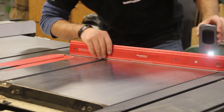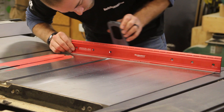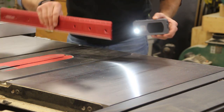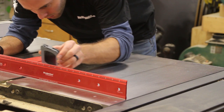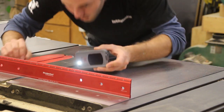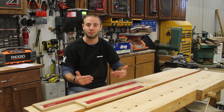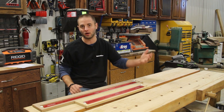These are very affordable for the tight tolerances you get. With that said, they are a skinnier unit — much skinnier on the base side than you'd typically see in a precision straight edge. We find that beneficial because we also use these when laying out joinery or things on sheet goods for template work. So these aren't just a dedicated precision straight edge — we use them in our everyday workflow as well.